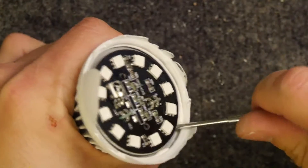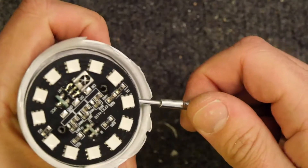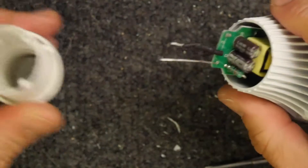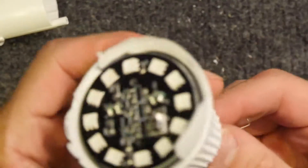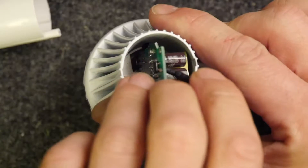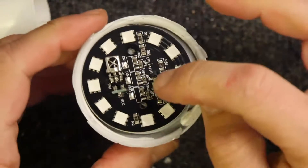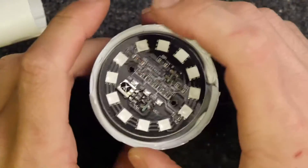I'm just trying to work out how to get further into this. I think we can probably just prize this off. There's a bit of glass going everywhere. So I can see what's going on — we've stretched something out. Those wires are pressed in, so once you've got this far you've pretty much knackered it. There's no really legitimate way of getting into this. The PCB has actually been assembled through that metal part — this heatsink is a die-cast piece, not an extrusion. These two legs and the power supply go through that metal part, so there's no way you're getting this off without some advanced tools.